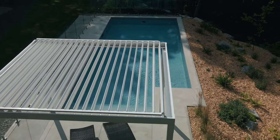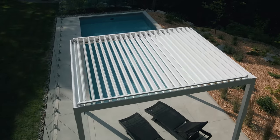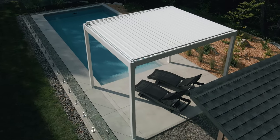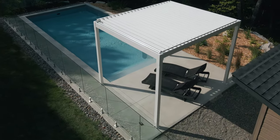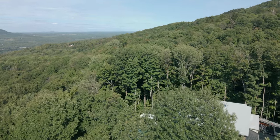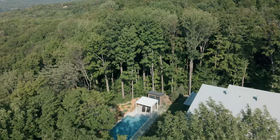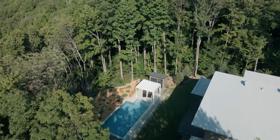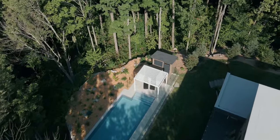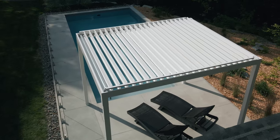Preparation. The direction of rotation of your blades is important to determine if you want to protect yourself against sunlight for as long as possible or allow the sunlight to flow in as quickly as possible. If you wish the sunlight to flow in, it is suggested to place the back of your pergola to the north side. Determine where the sun is moving during the day to place the pergola. Note where the back of the pergola is located — your blades open at 90 degrees towards the back.